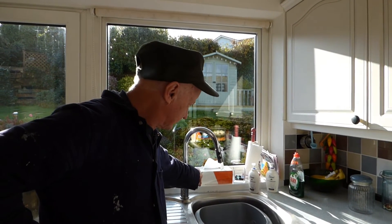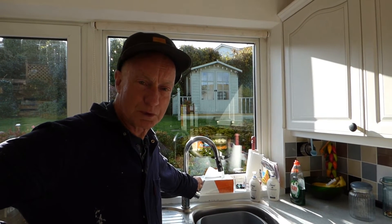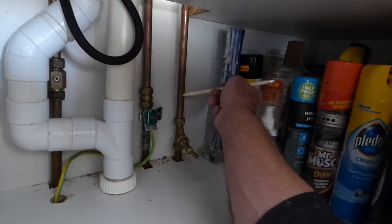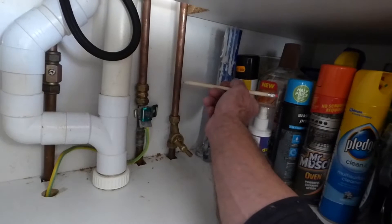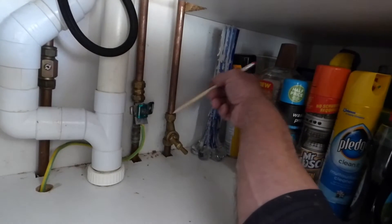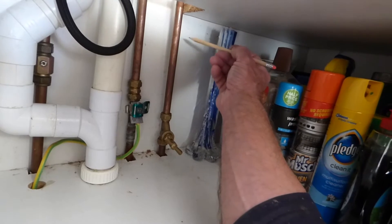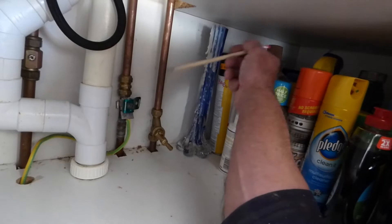Once the water's off, drain everything by opening your tap and letting any dead water come out, so there's not too much when you cut through the pipe underneath. Have plenty of old towels handy to catch the water. Mark where you want the bottom cut of the valve, then measure 34 millimetres up with your tape measure. The valve will sit over that section. If pipes are rigid, you may need to undo an elbow above to get movement; usually there's poly pipe near the tap going to the floor which gives you a bit of leeway.